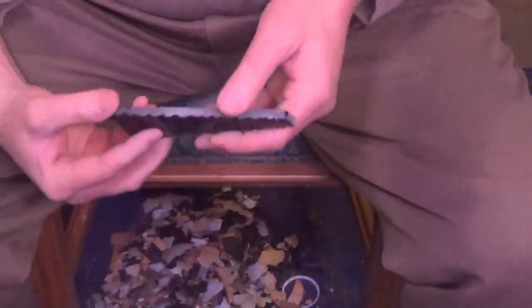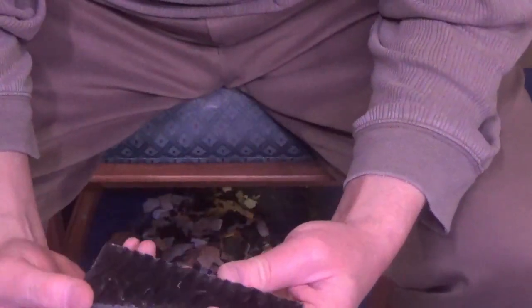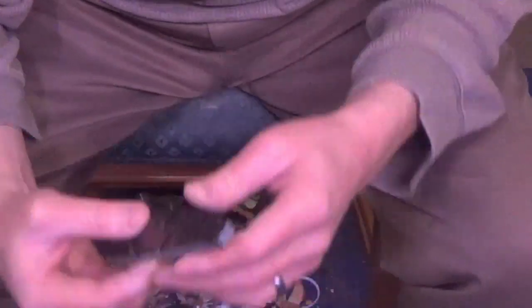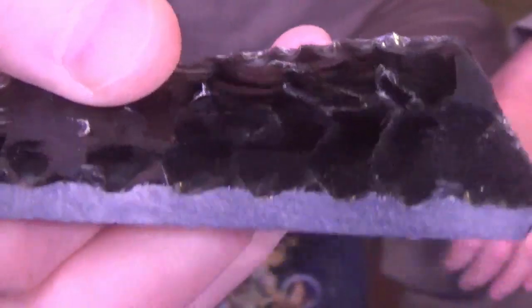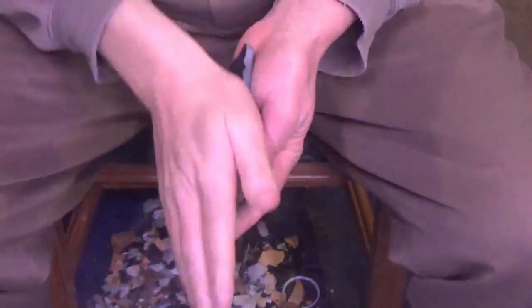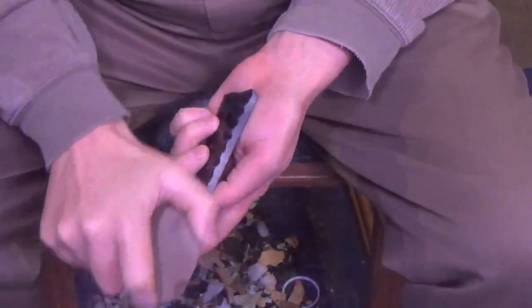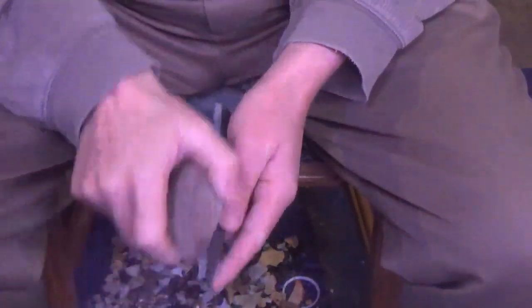Okay, so one more thing, T Wrecks911, that came to mind after I shut the video off: you had mentioned that you were getting short flakes on the second pass. That could also be because, look how steep the deltas are. Even when we take those little thin passes, maybe give your slab a little bit of a grind on the top. Okay, where'd my grinding stone go? Over here. Maybe a little bit on just that surface, and a little bit more.